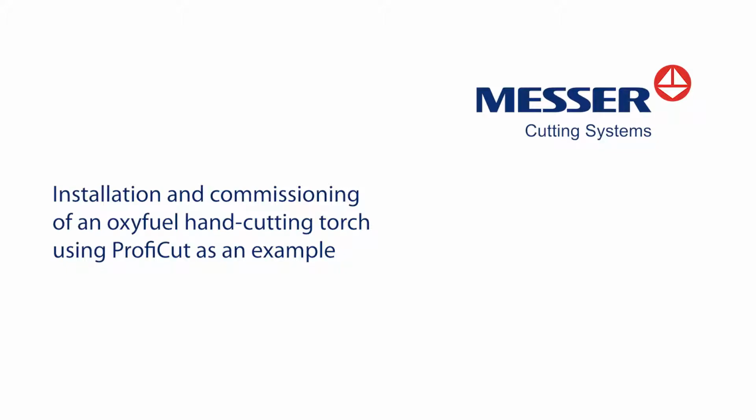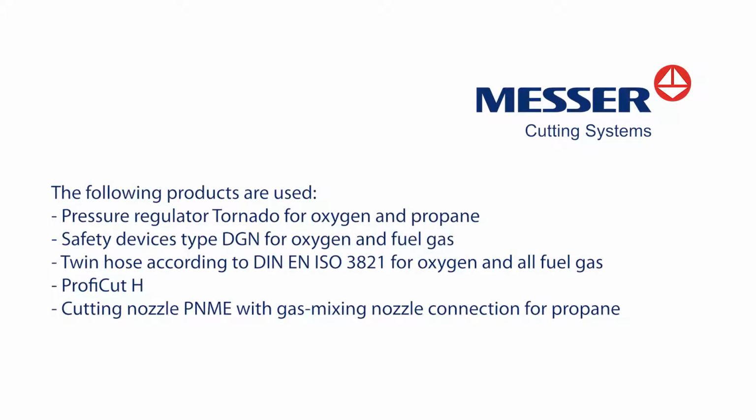Installation and commissioning of an Oxyfuel hand-cutting torch using ProfiCut as an example. The following products are used: pressure regulator Tornado for oxygen and propane, safety devices type DGN for oxygen and fuel gas, twin hose according to DIN EN ISO 3821 for oxygen and all fuel gas, ProfiCut H, cutting nozzle PNME with gas mixing nozzle connection for propane.